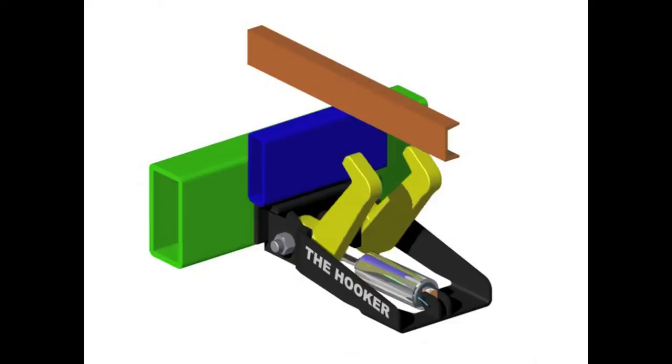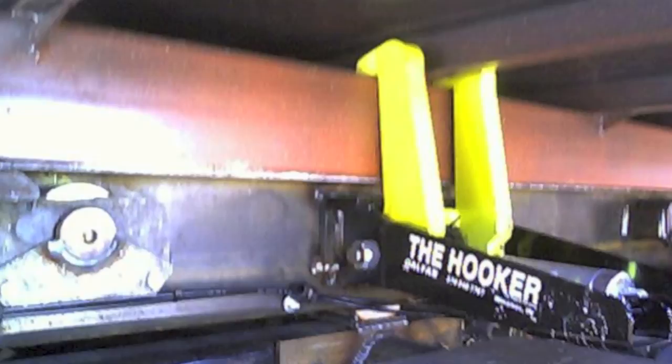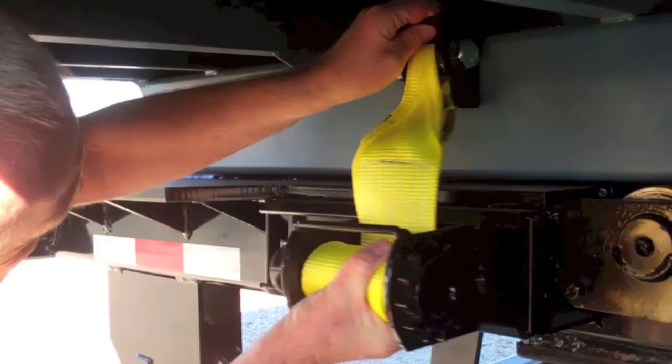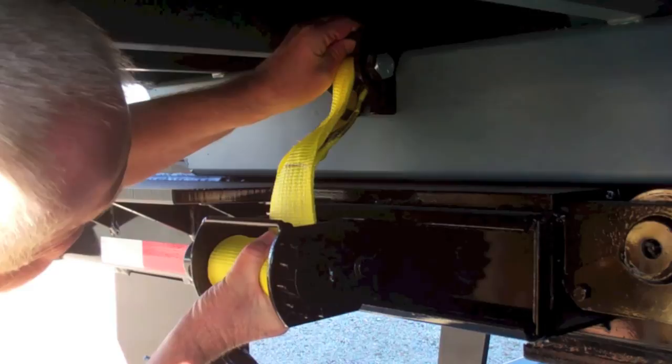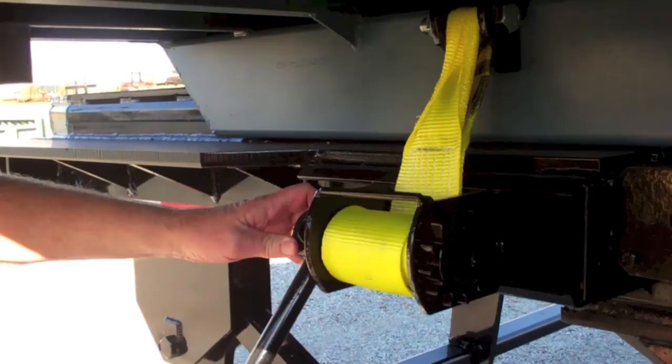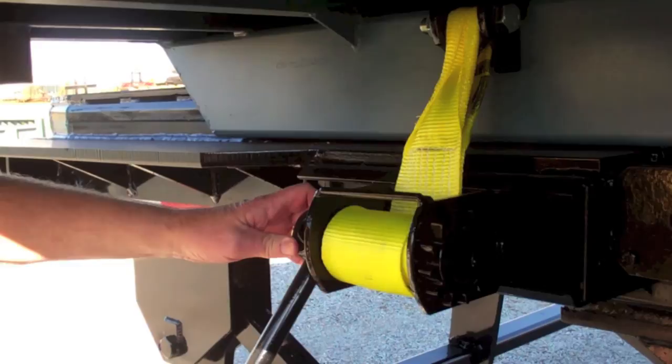Manual controls are available. The four hooker arms provide a potential vertical load capacity of 40,000 pounds each. Ratchet tie downs use a steel hook on 4 inch wide nylon straps and a ratcheting system to tie the container down. Each side has a ratchet and a securement strap; the ratchets slide in channels to line up with the spaces between the cross sills on the container. Both systems require an open space between the cross sills and space between the long sills and the floor to allow hooks or arms to engage the container long sills.